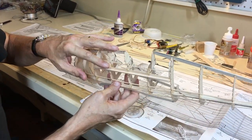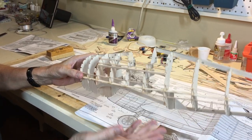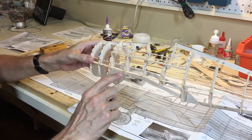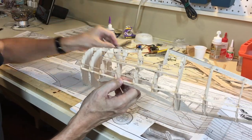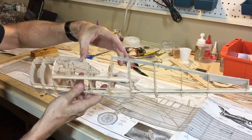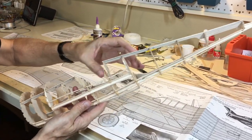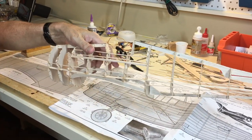One of the reasons I'm having the hatch fairly big is I have no earthly idea where the center of gravity will be, or where the equipment's going to be located. The center balance is right here, which is a normal place. The motor is fairly heavy. The tail surfaces will add some weight. To get the proper center of gravity, it's all where the battery goes. So I have to have access to a range of locations for the battery to locate the center of gravity.